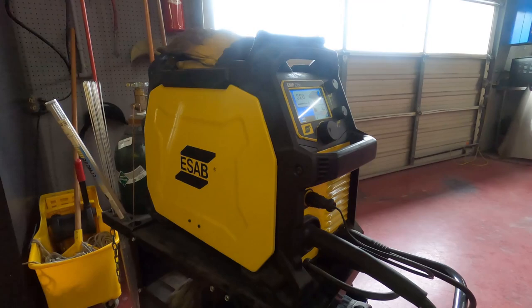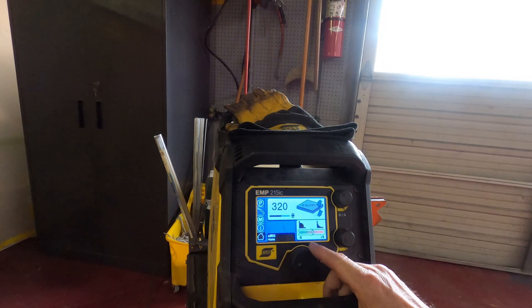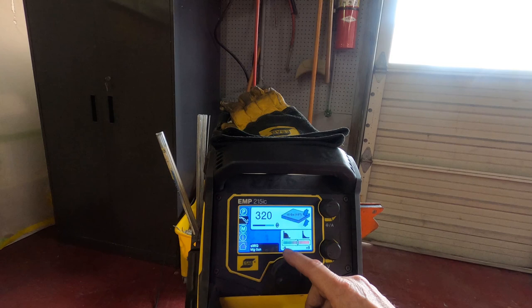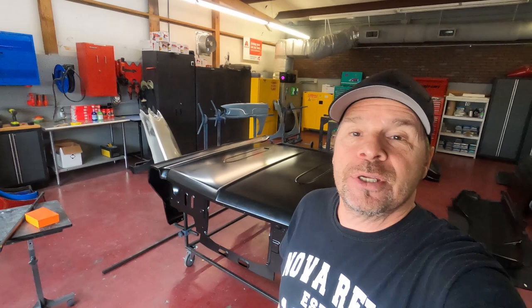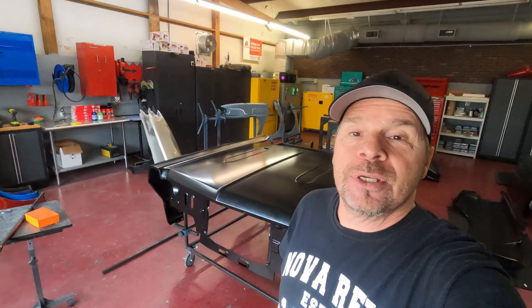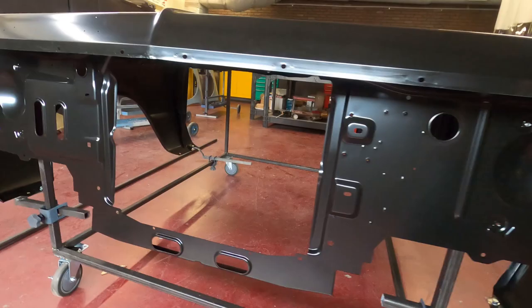We've also got to have a metal melting device. I've been using this ESAB Rebel 215 IC for quite a while now. One of the cool features is that it's got a feature called S-MIG. You can do a typical programmable MIG — it's got a spool gun, infinitely adjustable. But in the S-MIG setting, it sets the wire speed and the voltage to your particular metal in a couple of milliseconds. So for something like this, I set it on S-MIG and start burning metal — every joint here, no setup, it's computer-controlled.